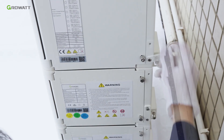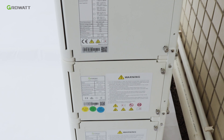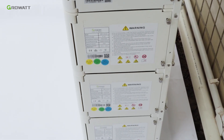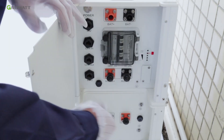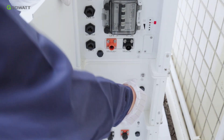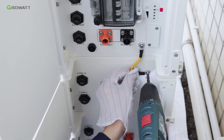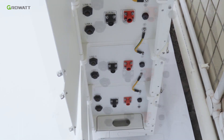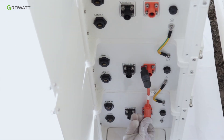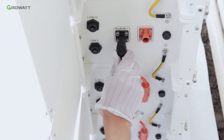Connect the metal connectors between battery packs, making sure all connectors on both sides of the ARC battery are well connected. Remove all dustproof covers attached to the battery pack. Connect the ground cable between battery packs. Then connect the positive and negative power cables in series between all the battery packs and power modules.